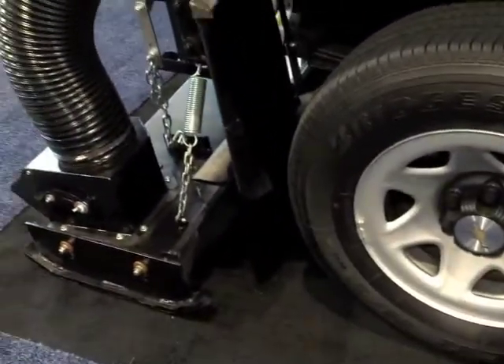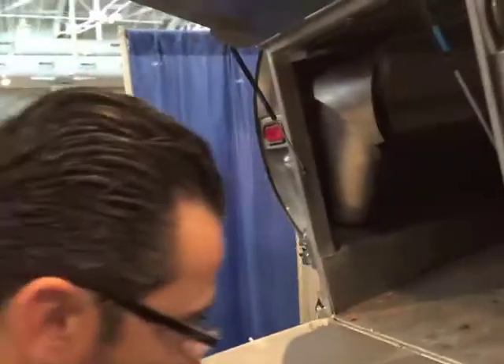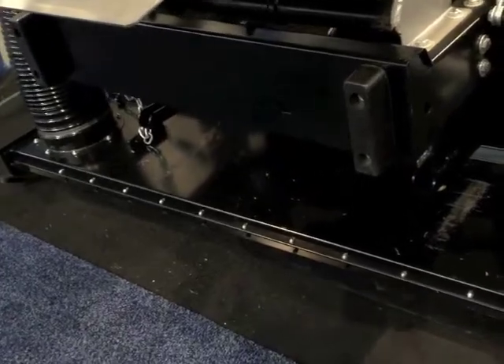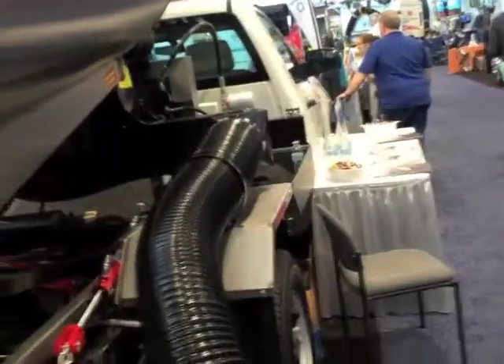The intake is at the rear of the sweeper — that's a Masco trademark. The advantage is it's easy to remove, replace, change the rubber out, and make changes versus raising the truck up on a center head, trying to pull it out, which can require two forklifts on an Isuzu. It can be a real hassle. I think the rear head design won me over and I made the best out of it.